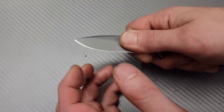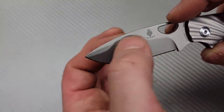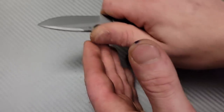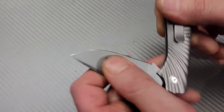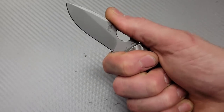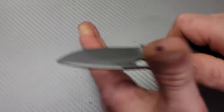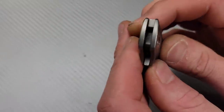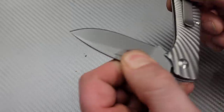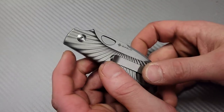You're not going to have to worry about the tip chipping or breaking — you can drill holes, whittle, or do some light duty prying. It's a flat grind that's not quite full flat, but the transition ledge is very subtle so it acts a lot like a full flat in cutting performance. Love the choil area — nice and close to the blade while being comfortable, and it'll prevent you from closing it on yourself. The star pattern milling is really nice in the hand and nice to the touch. This is just an amazing slip joint — love you guys, thanks for watching, peace.